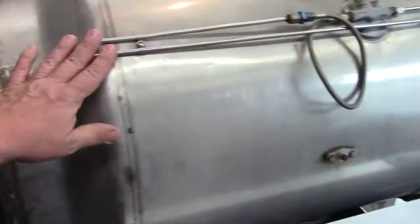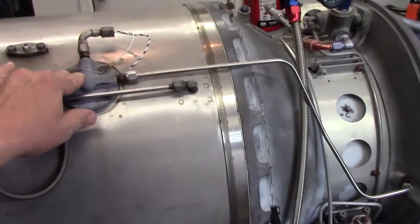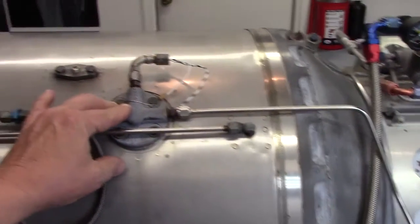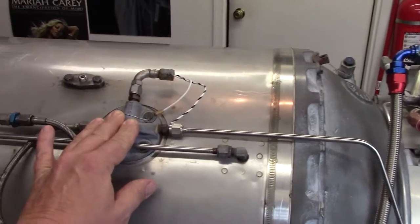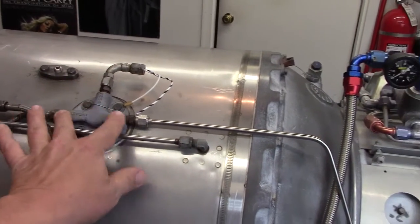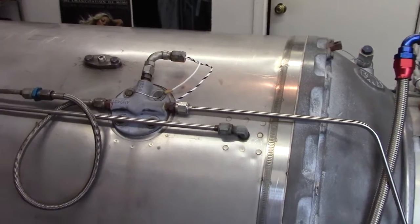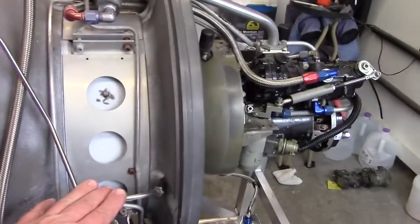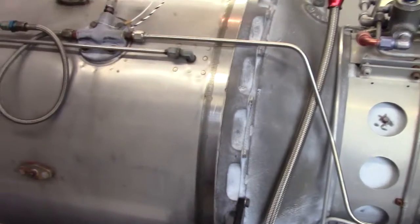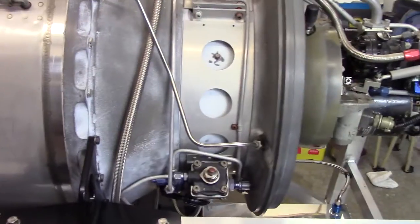These are oil lines — actually air and oil. Air is used to blow the oil through the bearing; this is an oil mist in this line, and that's generated internally. The pressure bled off the compressor case aerates your oil and then blows it out through these lines. This has an additional cooling air pipe because that is the turbine end, and that turbine down there is obviously hotter — that bearing is in a more hostile environment. This feeds the front bearing. There are two simple bearings on this engine.